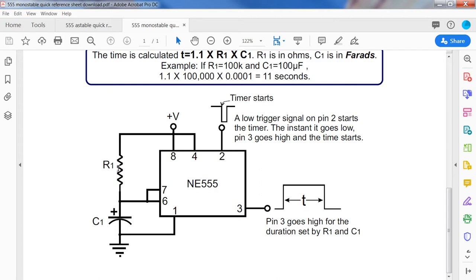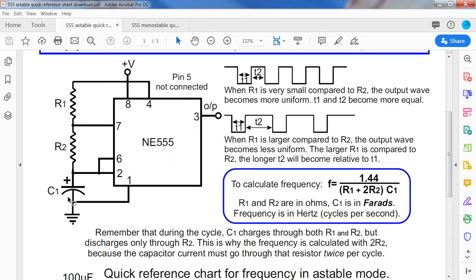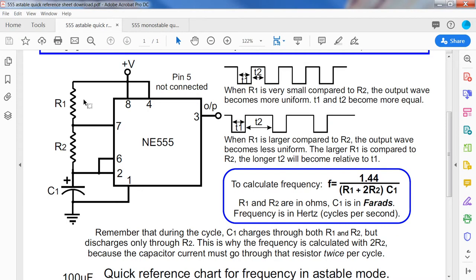Another way you can use the variable capacitance is to use the capacitive pressure sensor as C1 in an astable circuit, just like in my demonstration, send the output pulses to your microcontroller like an Arduino, and have it count the pulses in a set amount of time. Let's say it counts pulses for one second — yes, that's a long time, but you're in no rush, right? On my example circuit, I used a 1 megaohm resistor for both R1 and R2, and I was getting frequencies of between 32 kHz and 24 kHz if I squished it to maximum. That's a difference of 8,000 pulses per second, so theoretically I can sense 8,000 different pressures. It's certainly fair to say I probably have a choice of 1,000 different pressures that I can measure with reasonable accuracy.